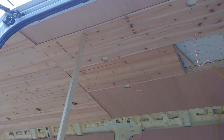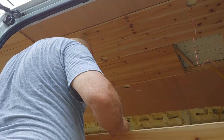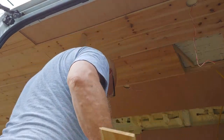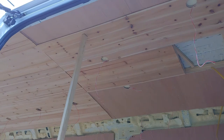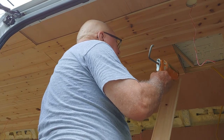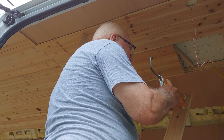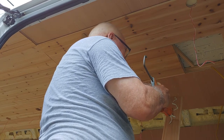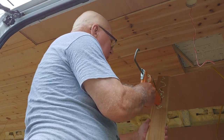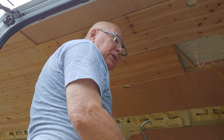Let's take the next piece here. Pick the smooth side — this is tongue and groove so it's got to go that way. The next step is to put some cement on the back of it. We're using liquid nails, right on the back of the piece. Usually I lay this on the floor and get a little bit neater stroke, but it doesn't matter as long as it's on there — that's what counts.